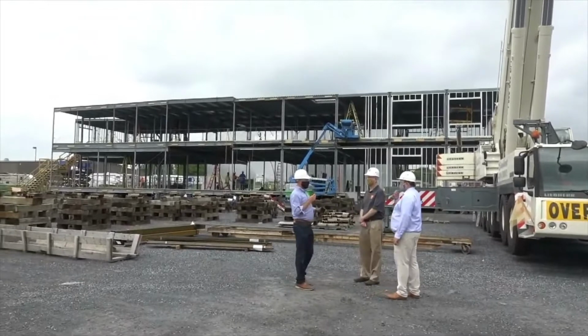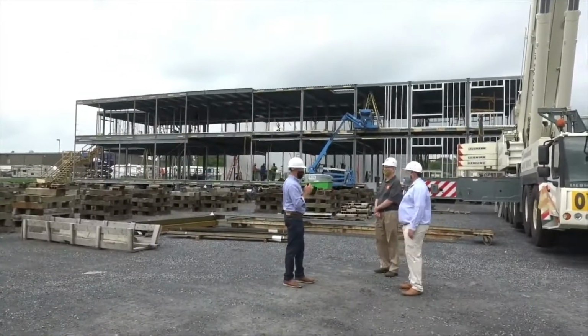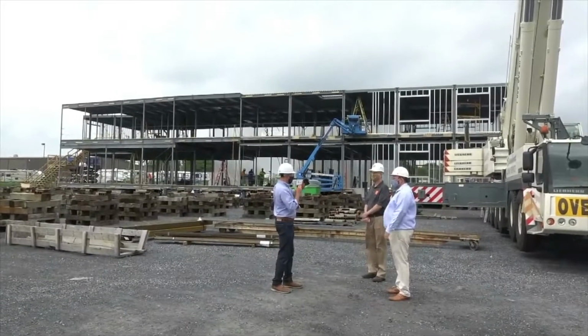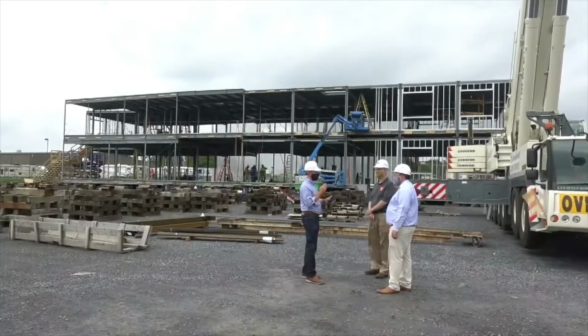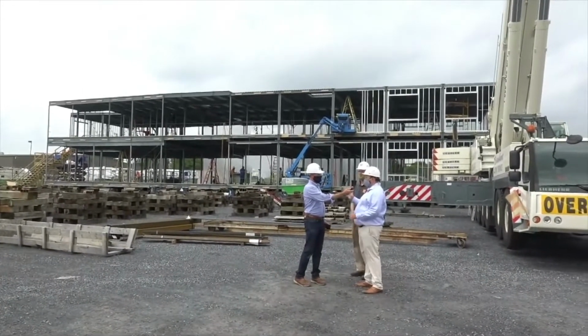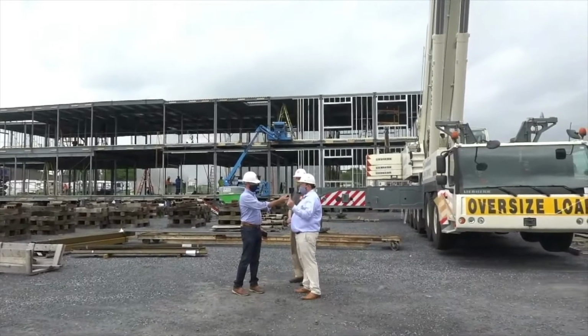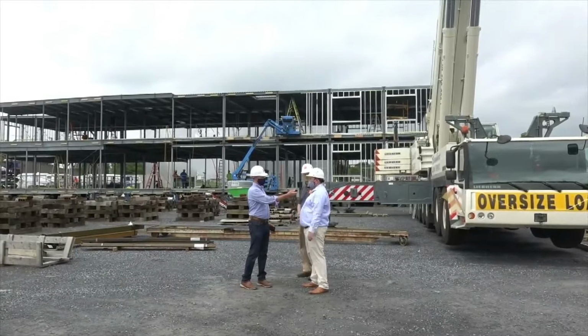All right, so here's an interesting thing. The trades come in, we know this building's coming apart, and with it coming apart, they're running the whole thing and then leaving space in between the modules, because they know exactly where the seams are, correct? Yeah, so they're going to run it straight through over top of the modular mate lines, and then they'll remove the pieces after testing, and that'll be the ship loose piece.